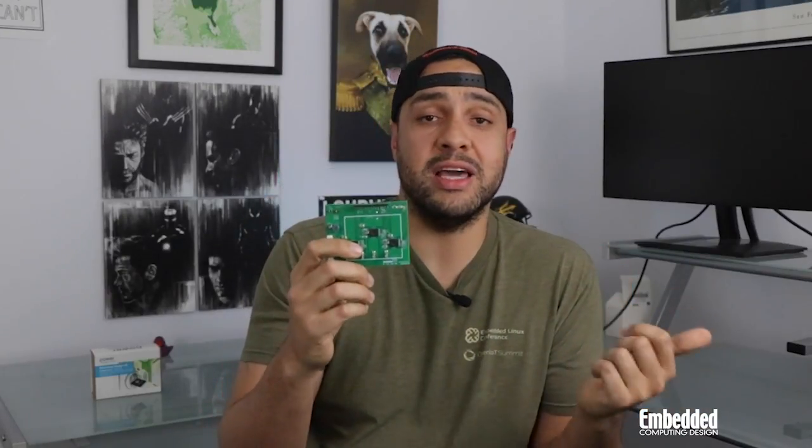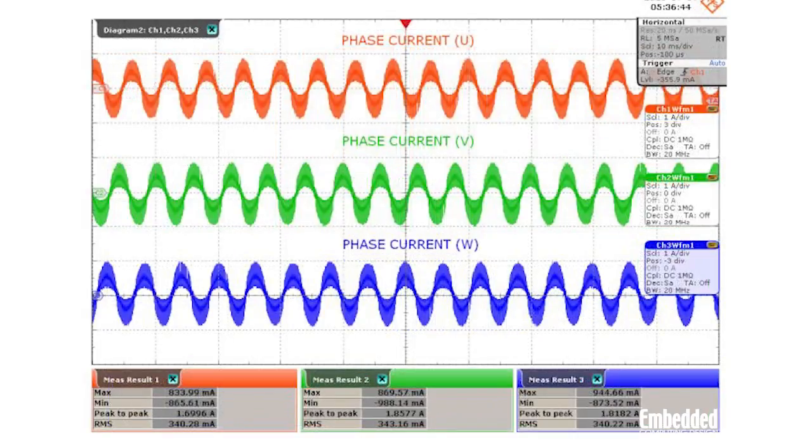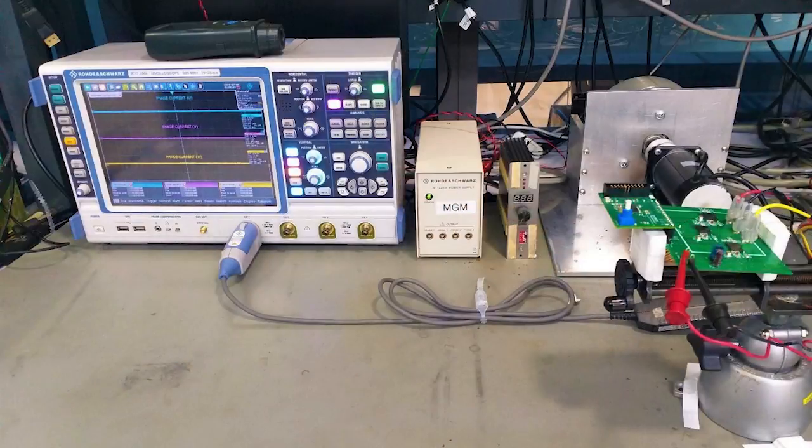Now that we've covered all that, we get to reap the benefits of the RDK 852 reference kit, like seeing how the aforementioned components perform under load. It's really great for analyzing things like startup power sequencing, steady-state phase voltages and currents, thermal characteristics, power consumption, and efficiency, in addition to a host of other parameters. If you check out the user manual, you can even find tests against abnormal motor operation and overloads on single and three-phase motors, and there are even tips on how you should set up your test bench to improve the accuracy of your measurements.